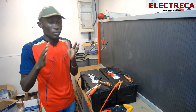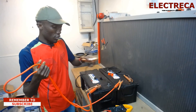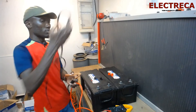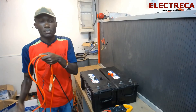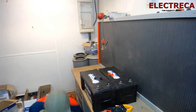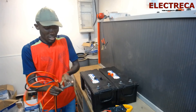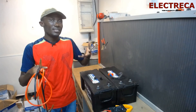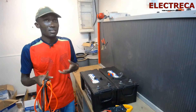What you have to do is minimize voltage drop as much as possible. I used long jumpers for demonstration purposes only. When you actually connect these batteries together, you'll need properly measured, shorter wires. The shorter the cables between terminals, the more precise and efficient the service you'll get.